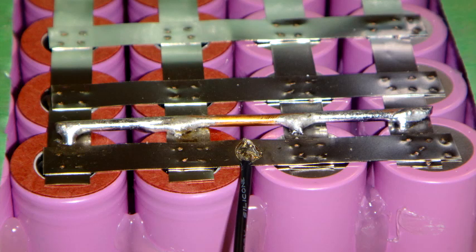Here's a close-up of the copper trace that is soldered directly onto the nickel strip. It's 2mm in diameter and I ordered it from eBay. I pre-tinned the copper with solder — you need quite high heat to get the solder to stick to the copper. The reason we do this for high power batteries is to allow high amperage to flow through, because the nickel strip on its own is not rated for 100+ amps. This really helps carry the current and keep things cool.